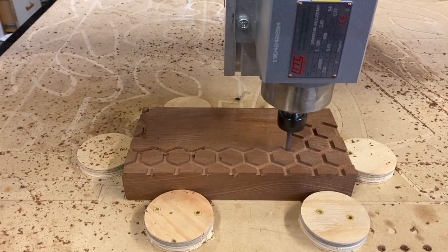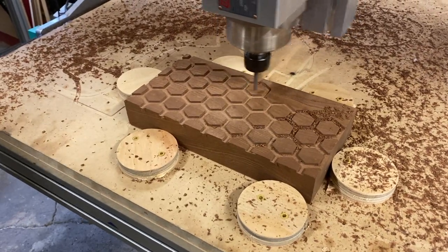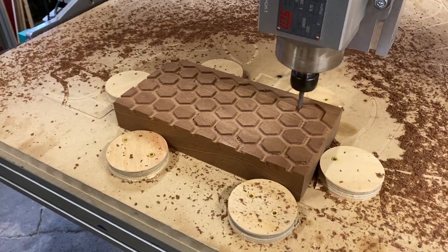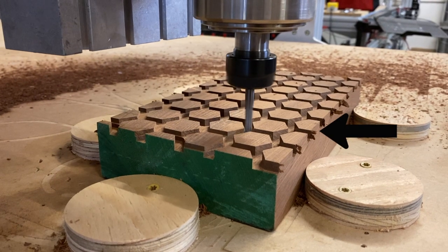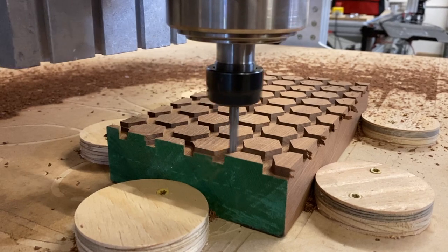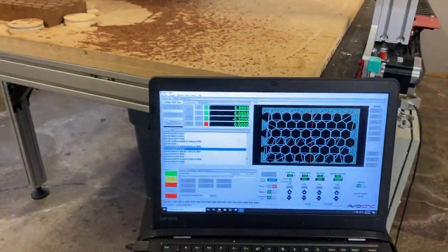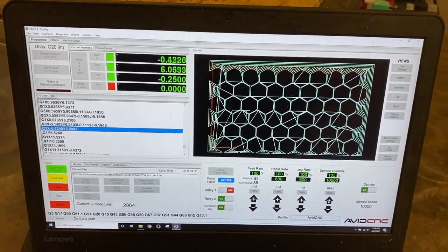Also, with these bits, it's extremely accurate — as in, I didn't even have to sand this board afterwards. It was incredible how accurate it was. The only chip-out and blowout areas were on the right side, as you can see. All the other pieces were perfectly cut and you didn't even need to sand it afterwards. I also learned that you'll want to make it easier on the router bits — we did two passes to get a quarter inch down, meaning an eighth-inch pass two times versus a quarter-inch pass all at once.